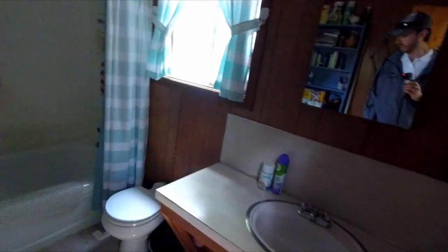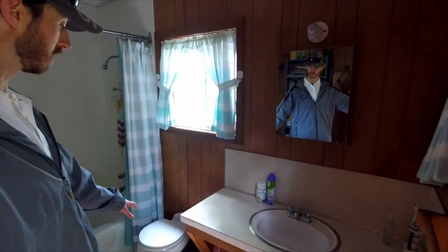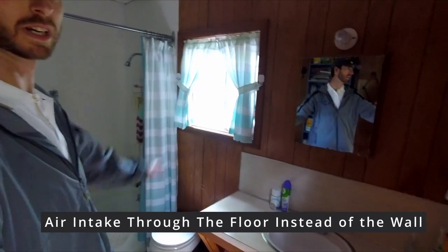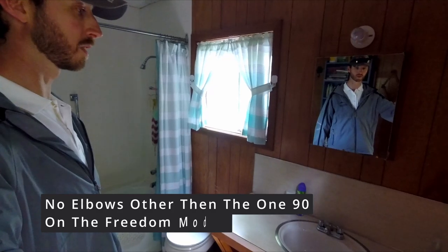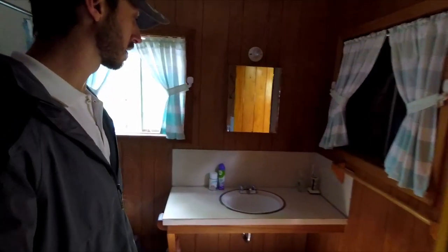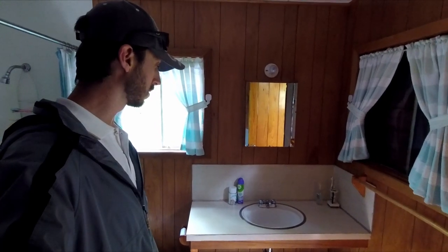Coming into the bathroom, our original plan was to put the new toilet where the current toilet is and use underneath the toilet as the air intake vent. But our first challenge is there's a window right there. With the gas model, you can't put any bends on the exhaust venting. We're confirming with the owner whether to go straight up behind here or move the toilet location, which would mean adjusting where the sink is.